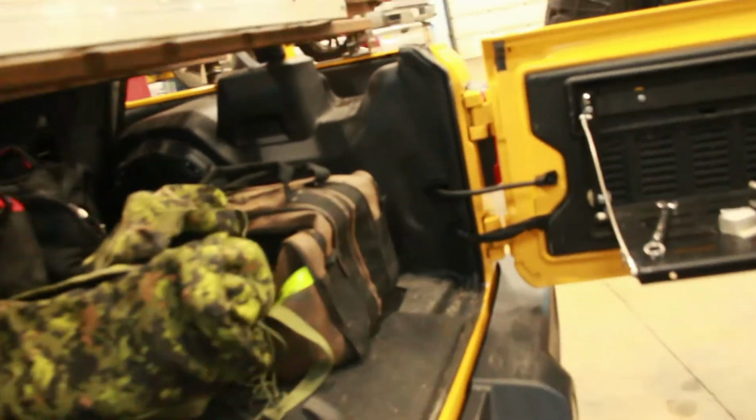All right, so you guys can get an idea of what we have done so far. We have risers welded to our mounts here, and we have been mounted in the hard top mount spots. Then we have a couple nuts and bolts holding their big long rails on there, and then to hold the rack onto those, we have a couple more holes drilled, four in total. Now this will be disassemblable fairly easily by taking these bolts and nuts out. And you can take your rails right out after you take your rack off, of course.